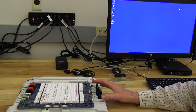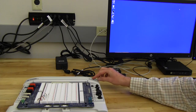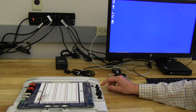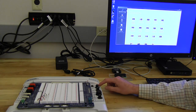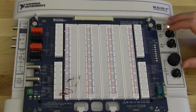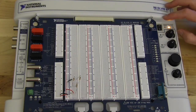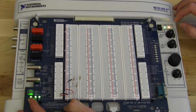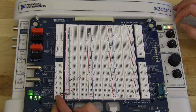Once you have your circuit wired up to your protoboard you will want to turn on the power. The power switch is on the back right of the ELVIS right behind the label. As soon as you turn on the power you will get an active and ready light on the ELVIS and your NI ELVIS instrument launcher will pop up. To turn on power to your protoboard and through the headers you have to flip the switch on the front of the NI ELVIS that is in the top right corner. Once you flip that switch the green power light will be shown on the protoboard, and you can also see in the bottom left LEDs indicating you have plus 15, minus 15, and plus 5 volts going to your header, so now we have power running from our header into our circuit.